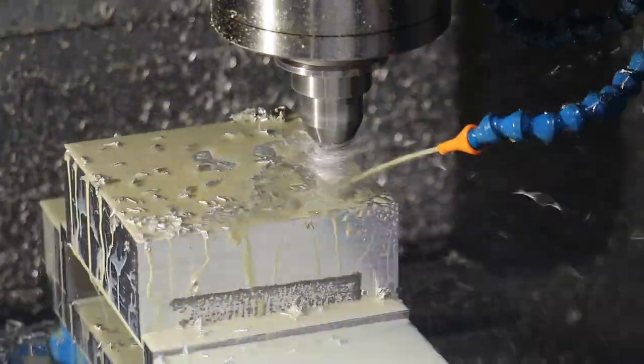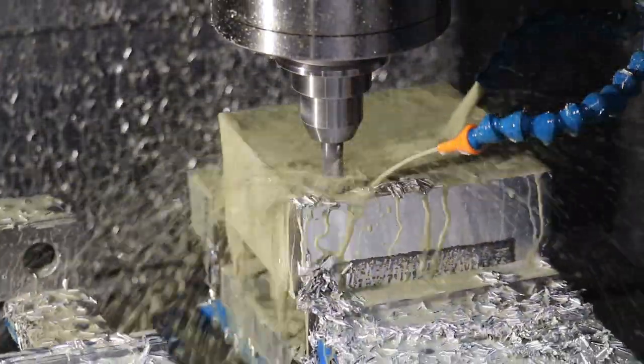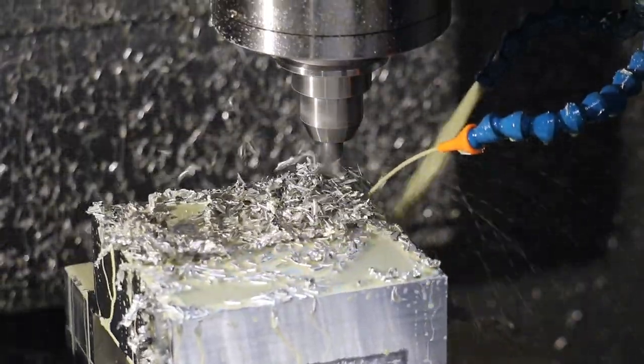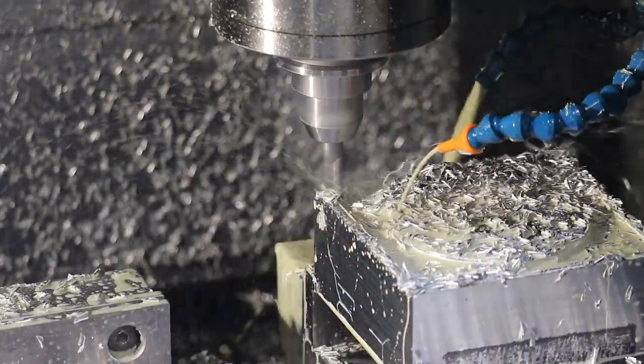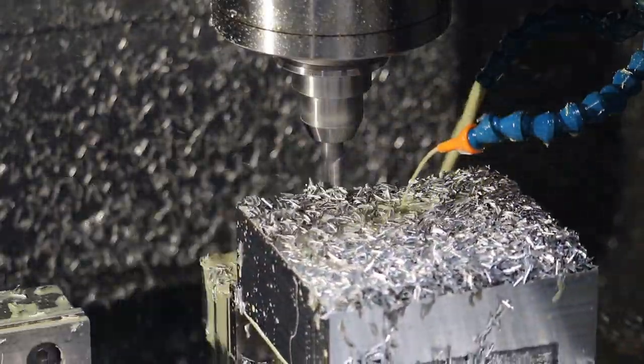And those cost about $40. And now we're going to machine the alignment ring for the A side of the mold. This is a program that I basically have saved for all the 6-inch molds. It's basically just hogging out material all the way around, and then it's going to leave a 110mm